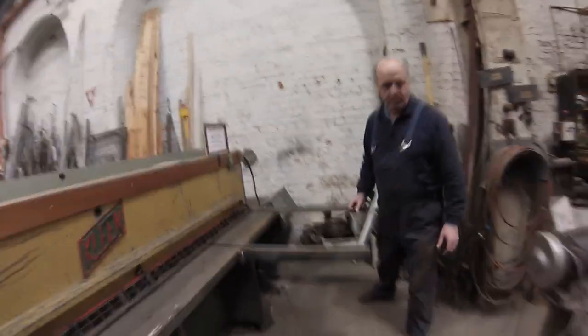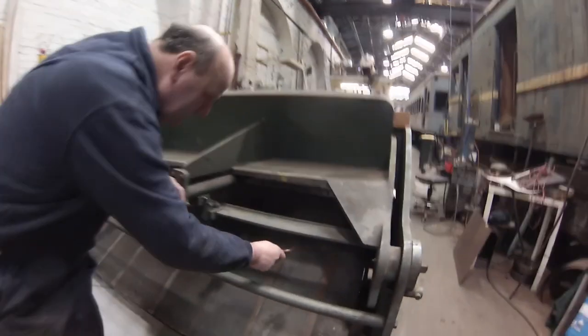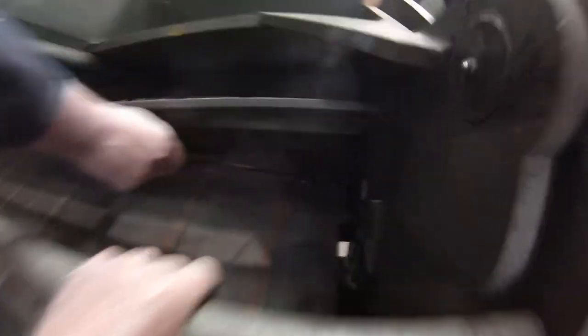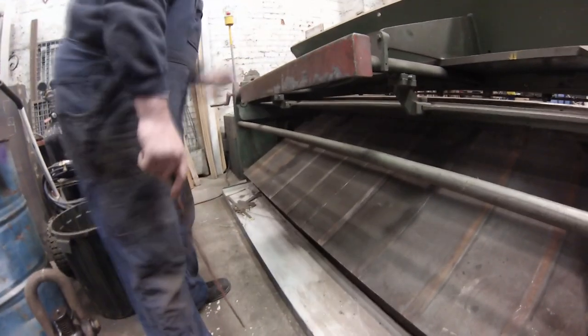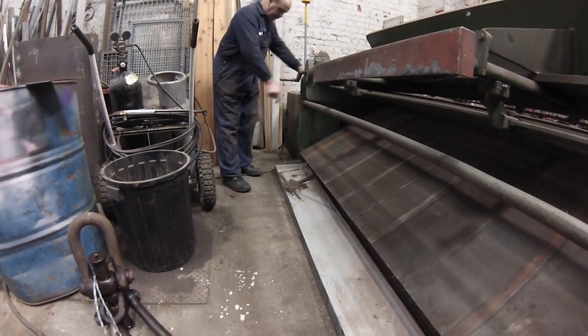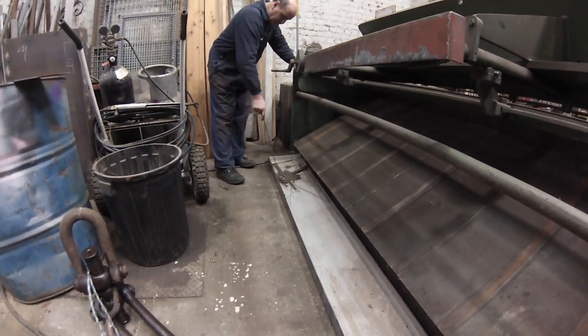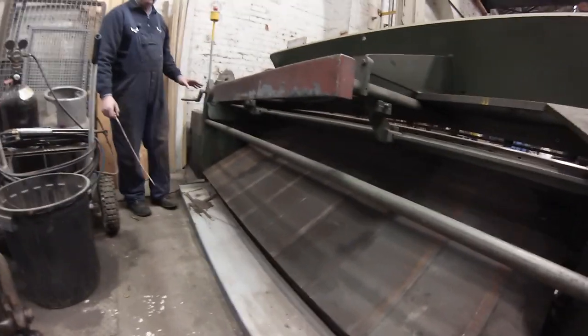We'll go around and have a look at the back of it so you can see what we were doing. If you come around here — you can't see the pistons anymore because we've got the slide plates in — but there are the power pistons in there. That's what we had to take out, with all these plates out. The other thing we made for it is a steel catch tray, so that when you cut the steel off it doesn't slide onto the floor. It slides down the slide plates and into the catch tray. As you can see we've got a few pieces in there from work we've already been doing. This guillotine is an absolutely fantastic bit of kit and it's really good to have it operational again.